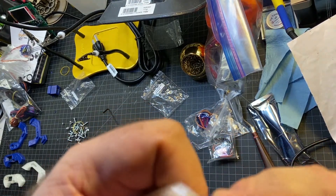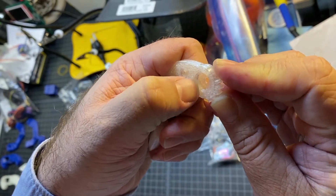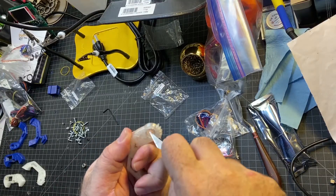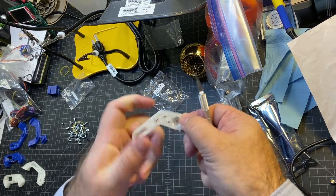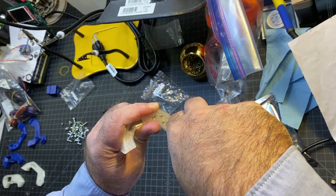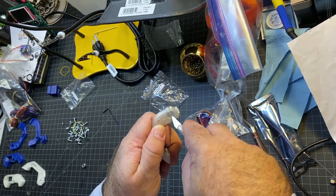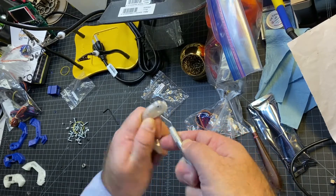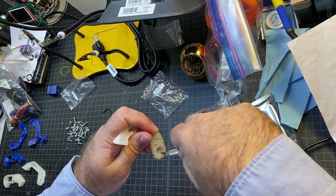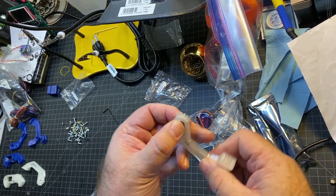In mine, you can see there's a little bit of filament from where it started and stopped. So I'm going to go in there and file that down a little bit. I also use X-Acto knives — little humps like that are easier — and just go around and clean it out a tiny bit. You don't want to do too much because you don't want it too loose. After clearing a little bit of material out, I was able to get the bearing in there.